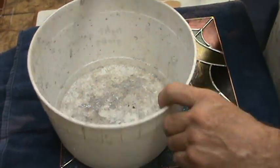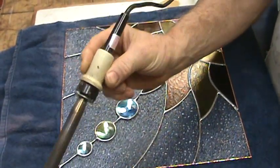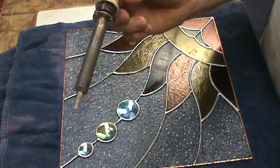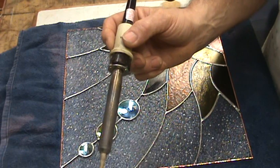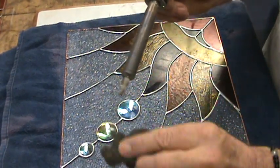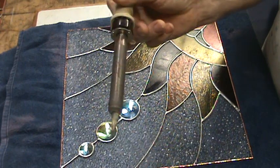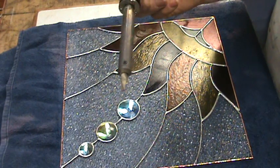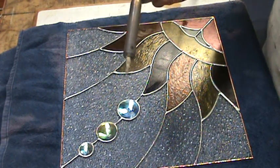This is a maroon and white Inland 100-watt iron. I like them the best — they're cheap irons, they generally last a good long time. I like the 1/8-inch tips and the 3/16-inch tips. They're fairly inexpensive and last me at least a year, which is pretty good considering the amount of soldering that I do.